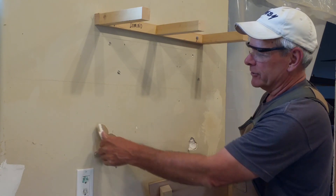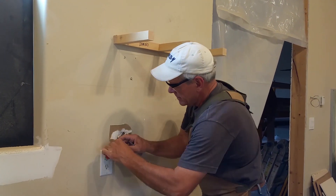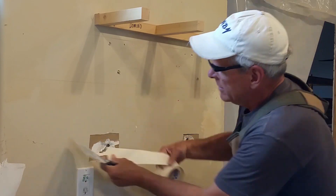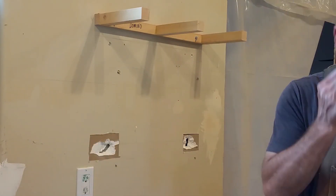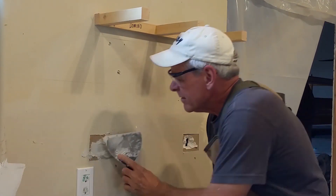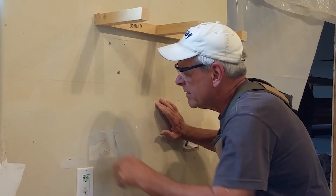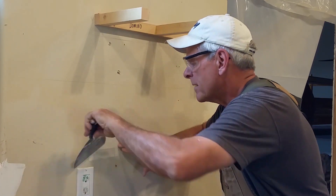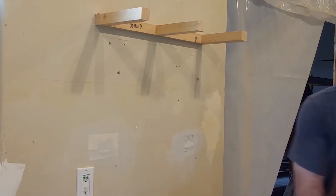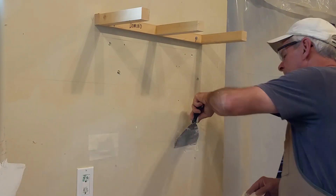Next week's video will show how I built these both with the Domino and with the dowel. You should be able to be pretty confident this will handle anything you want in the way of a floating shelf with typical household items. The way to ultimately test the strength of the dowels compared to the Domino shelf supports would be to connect directly to the studs in the wall, which takes sheetrock out of the equation — then you're matching screw strength in the studs to the strength of the domino and dowel glue joints. Let me know what you think in the comments, thanks for watching, and subscribe to Dobbs Workshop.